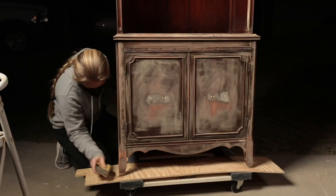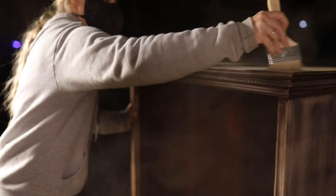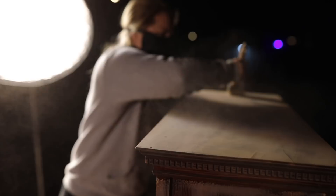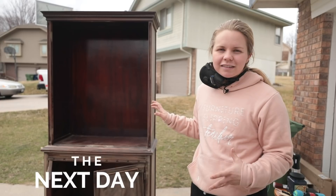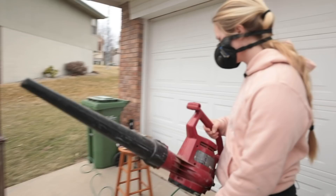Now I'm going to take my brush and wipe away all the dust, then grab my microfiber cloth for the final step to get all the dust out. I just finished up with the detail sanding around the spots I missed with the sander, so now I'm going to use the blower to blow all the dust off quickly, and then go back with my microfiber cloth to get any remaining dust. Hopefully it doesn't blow over the hutch.